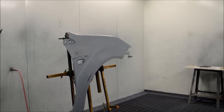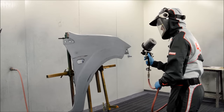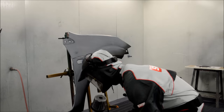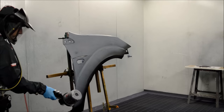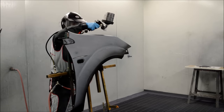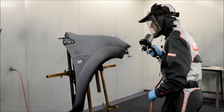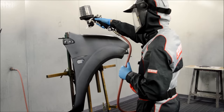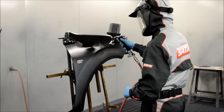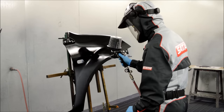One thing I will say before I actually start priming is that this atomizing head I'm using is the 1.8 setup. After speaking to a few guys on Facebook, turns out the best one to use — what they found — is the 2.0 setup. It just helps get that bit extra primer on there and you get a better finish. This 1.8 setup does do a good job of getting the primer on, but I have noticed it is quite texturey and peely, and they've got better results using the 2.0. I can't comment on that one just yet until I get some. But the primer does spray quite nice — I can go quite quick with it and the finish is acceptable. The gun is very different to a normal spray gun; it's different to use but it just takes a bit of getting used to, like it is with every spray gun really. After a few plays with it I'm sure I'll get used to it.